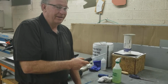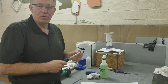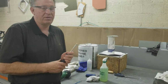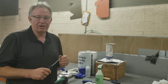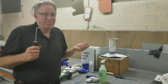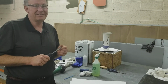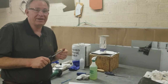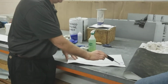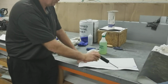The other thing about probing is that you actually have to do physical damage to the sheet some of the time in order to make sure that you're probing hard enough. If I weld 300 feet of seams and I go back and probe my work, I better plan on damaging the sheet myself maybe 3 or 4 times in that 300 feet, where I have to actually patch it when there was no defect. Because if I'm going to probe with these 2 fingers right here so I don't damage the sheet, I'm never going to find out where my deficient welds are.